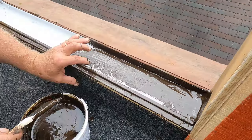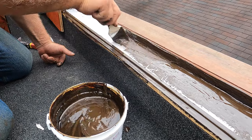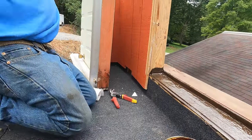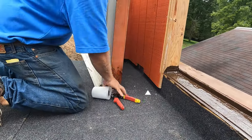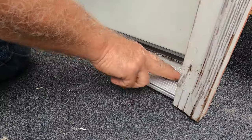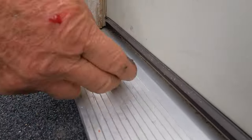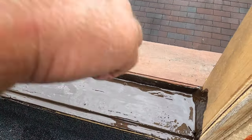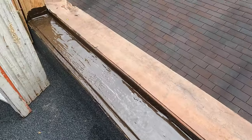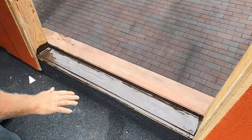Now I have to do this as well — coming over this plywood and over the roof here. This is the inside part, but there's another place where water leaks. If you don't have that covered, water will travel underneath this wood here, on both sides, and go right there — filling up this pan. You cannot skip this. This is super, super essential.